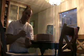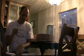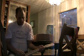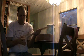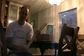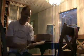And what happens is I have a sleeve on there that's very tight, but the rod can also move inside. Then I stick it in, and I put a filler strip of this precise width and mash it in there so it keeps this truss rod from rattling inside the neck. And then I cut it flush with a saw, then I plane it flat.